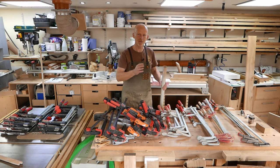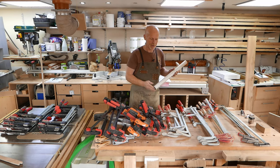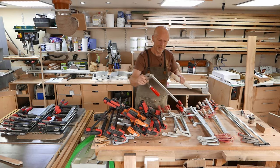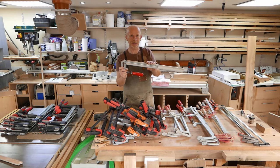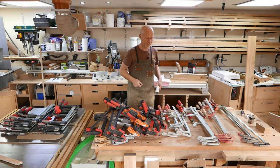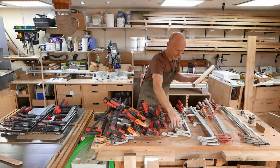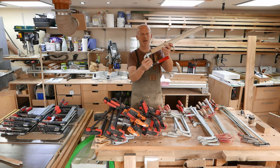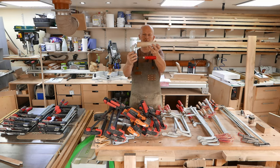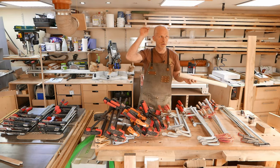I need to be able to see what the length of the clamp is, or to know what the length of the clamp is without having to pull it out. So that means I really need to cut the pipe to suit the length of the clamp so that I can see at a glance that that's a shorter clamp and that's a longer clamp. And I also need to make sure that the pipe's not angled, allowing the clamp to slide out. So ideally, a slight back angle, or at the very least, completely level. And my ceiling's on a pitch.